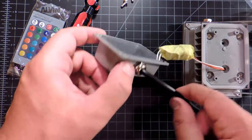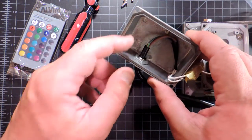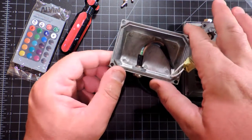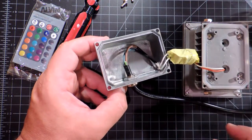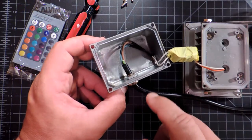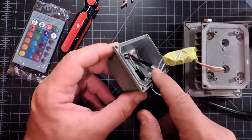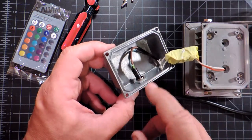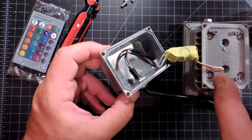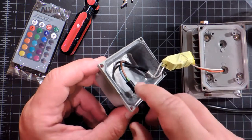The back case is now open. This is the AC cord coming into the product, and you instantly notice the first really serious safety violation. The green wire here is the earth ground, and that has to be connected to the case should there be a fault where the live lead connects to the case — so the circuit breaker back in your home can snap off. Obviously that's not going to happen with this particular arrangement. I didn't buy this unit to use it; I bought it because I couldn't believe how cheap it was. It performs surprisingly well optically, but you can see some really scary things.